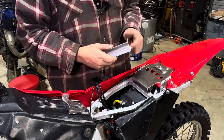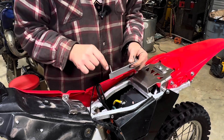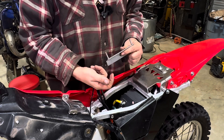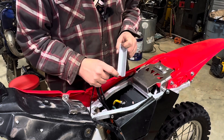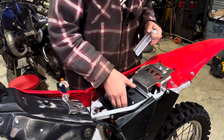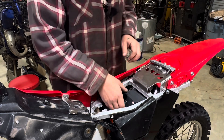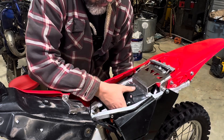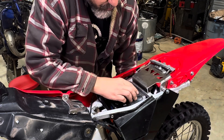Let me show you what I've come up with. I took this piece of metal here, drilled a hole in it large enough to tap for M6 bolts going through there. I ran the M6 bolts through — they're just tapped, they held in there. I cut them off and ended up welding the tops and ground them smooth. The reason I did that for this design is I want my motor controller to sit like this.